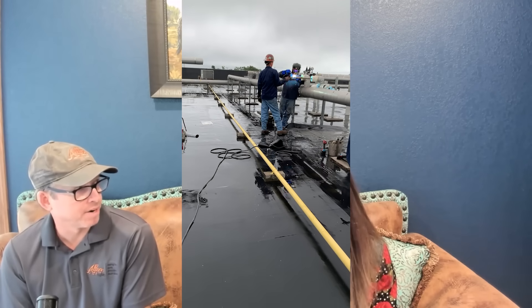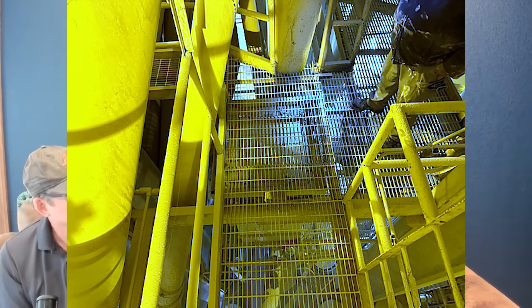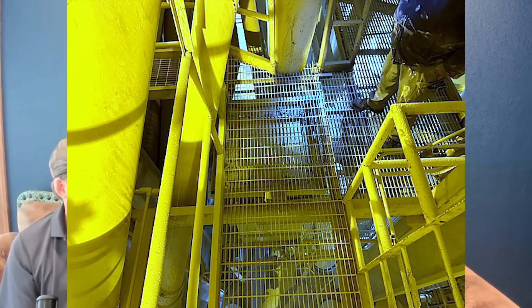Firewatch training would be the first thing. But the second thing is we want to cover where we're standing. Because if I've got someone who's welding in a room across multiple areas, do I have my firewatch stand where the person's welding and move with them? But how are they watching the first four welds? 200 feet of pipe on a Saturday — we're welding, or we're elevated. I got sparks shooting everywhere.